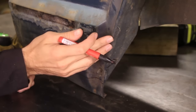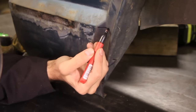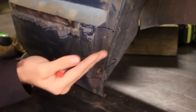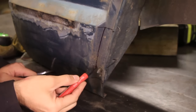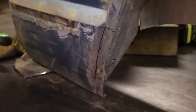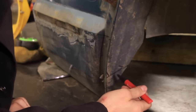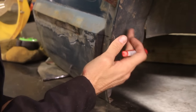On the front side here you have this pinch seam. We're going to take that and cut it off even with the line where we're going to fold everything up — make a straight line across here. We want to keep this little edge right here; that'll help fold up and over and kind of keep the water out and give you a better seal. So we're going to cut that line right there. For this little triangular piece, I've drawn a line from that four-inch mark on the inside to that five-inch mark on the outside and we're going to cut straight across there. Don't cut up here — we're going to fold that in.